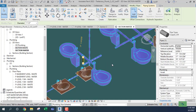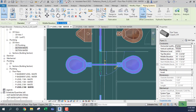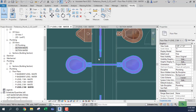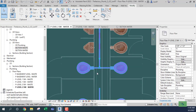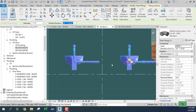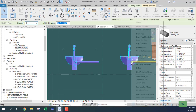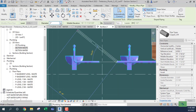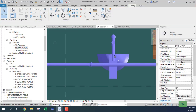We need to do the same for these two water closets. Let's back this pipe up a little and come back to connect here. That's going to be a two-inch, then I change it to a one-and-a-half. Going back to the section view, let's erase this, make that a two-inch — just make it two-inch — then come over and transition to one-and-a-half. Make that connection, come back, and I think I can just come down.